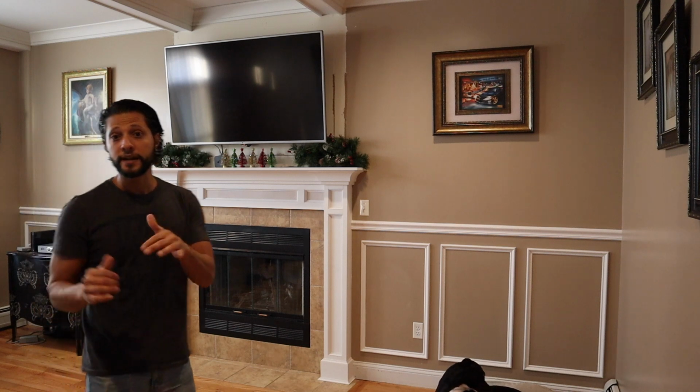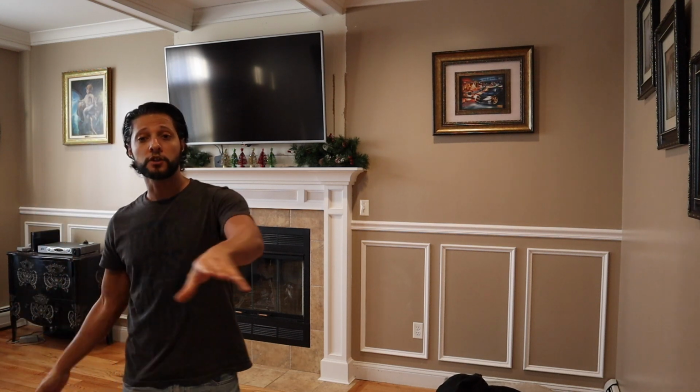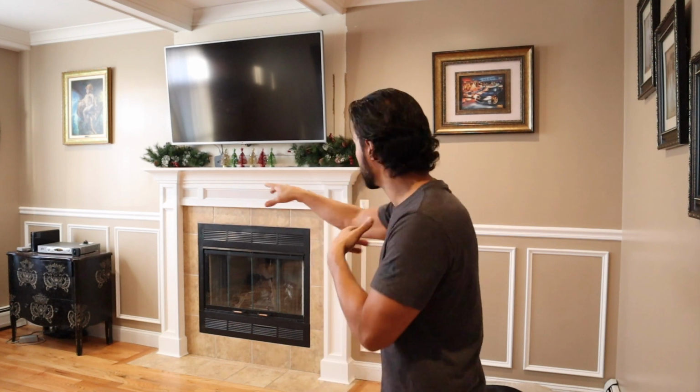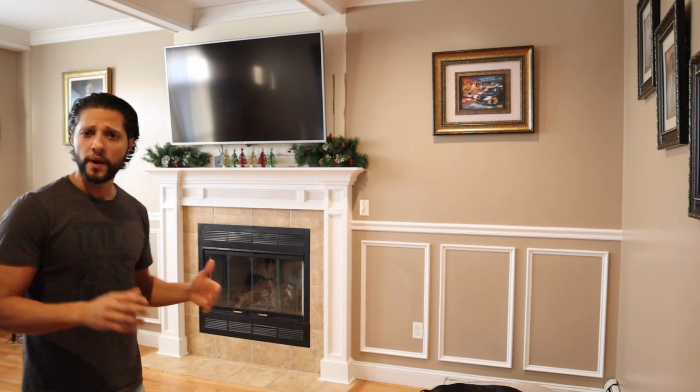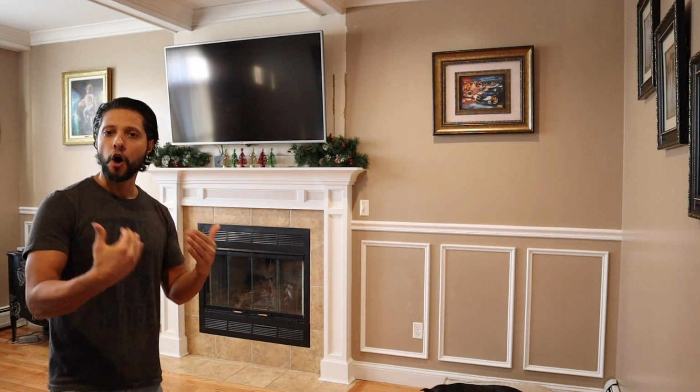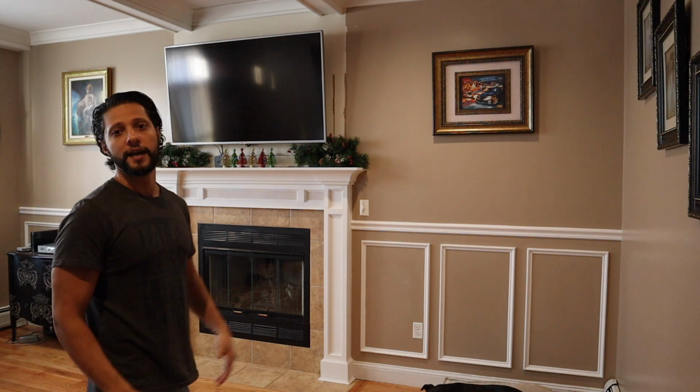Okay, so if you need to tweak that side of the wall, say on the other side of the fireplace, if I had to go 3.25 inches as opposed to 3.5 inches or 3 inches, no one from this distance is going to see the difference of that 1/4 inch. The spacing, if it's even consistently all the way around, everybody's going to think it's exactly on with the other side, and they'll never notice it.